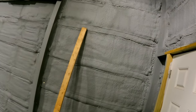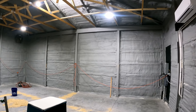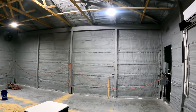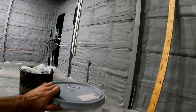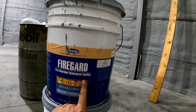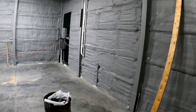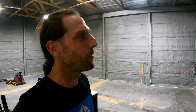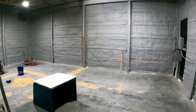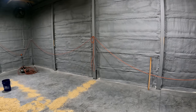In the garage you'll notice more of an echo because I went with closed-cell spray foam — two inches of it — and on top of that they sprayed a fire-guard fire-retardant waterproof coating. It's gray, and the first thing Jen said when she came in was 'what made you go with gray?' I thought it made it a little bit dimmer in here, but not a big deal.